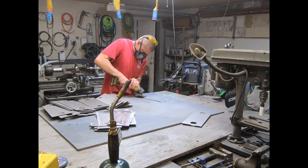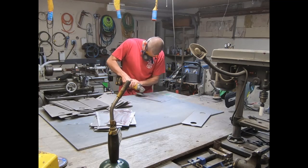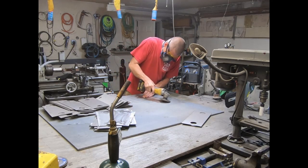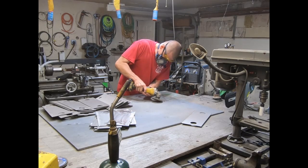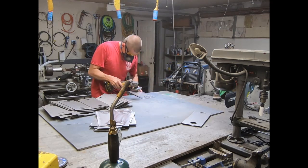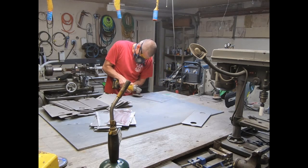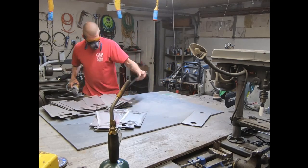What's going on fellas, burning the midnight oil tonight. Just want to show Muhammad what's going on — we're working on his project this week. I've got a huge stack of stainless steel 304 plates that need a little cleanup. I haven't quite got the plasma table dialed in, so there's a little stalactite and stalagmite action going on, and that needs to be ground off so they don't touch each other during compression when tightening up the gaskets.